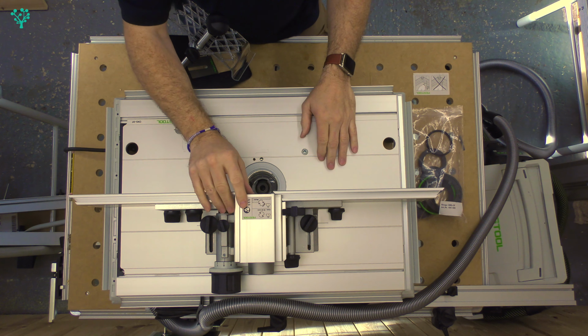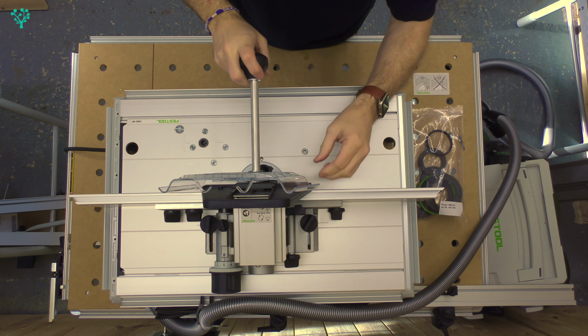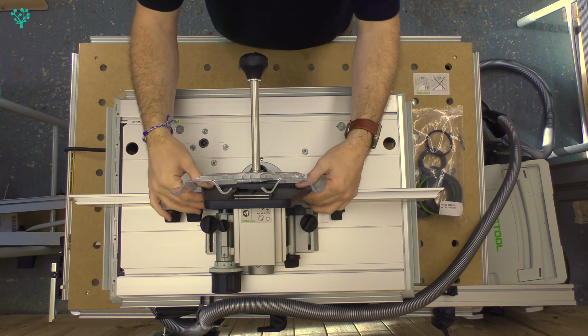which is why I think that piece of rubber is a packing piece. Installation is simplicity. This just locks into there. As I tighten this knob, you can see those wings at the back start to compress, and that just puts pressure inside there and locks everything into place. You want to position that so it just neatly drops down in front of the fence. You don't want it clogging, and then you can tighten that down, and that is done.